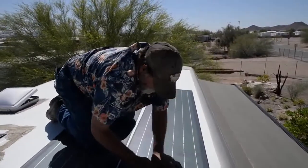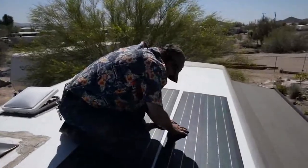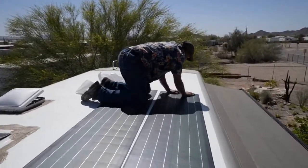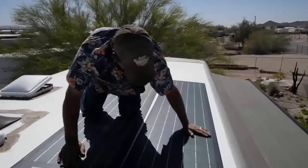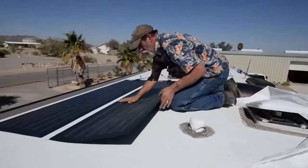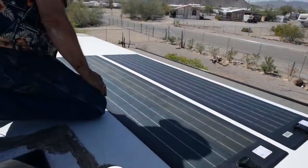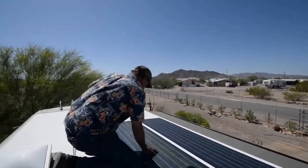It should let you walk all the air out from underneath the membrane so you don't want to let water get underneath them. You can feel where you've got little pockets of air. It's not a point of getting it as flat as you can get it - it's getting it completely stuck to the roof. There's one. Now we let the sun do its work and get them all the way down.